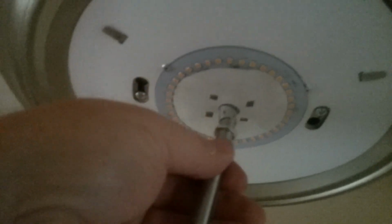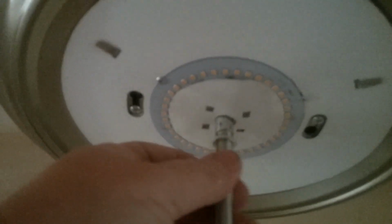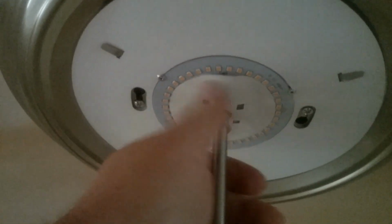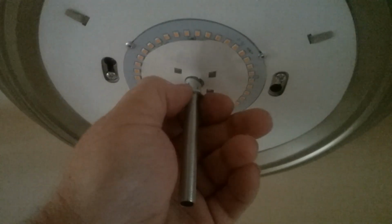And I'm fixing to show you how to put this stem on. This will hold your globe. This stem, now you see, usually comes with a little nut right here. Goes up in there. I was going to bring my tripod today and I completely forgot about it. Now that nut is a stop nut. You want a lot of threads. You can adjust it up and down, but when you screw your stem in, it stops. Screw that nut, tighten that nut up.